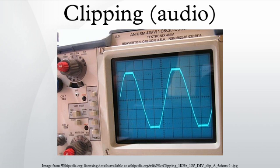Repairing a clipped signal. It is preferable to avoid clipping, but if a recording has clipped, and cannot be re-recorded, repair is an option. The goal of repair is to make up a plausible replacement for the clipped part of the signal. Complex hard-clipped signals cannot be restored to their original state because the information contained in the peaks that are clipped is completely eliminated.